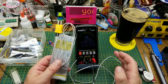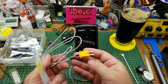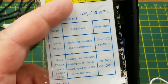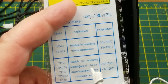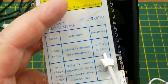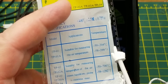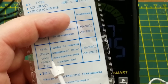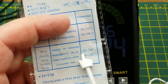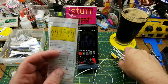The most common ones are defined as K-type thermocouples. Here's another type you might find very commonly - again it's just got that little tiny sensor on the end of it. This one with just the cloth jacket is rated for minus 58 to 399 Fahrenheit accurately, but if you get one with a heavier duty jacketing it can go all the way up to 700 Celsius or down to minus 50 Celsius quite comfortably.